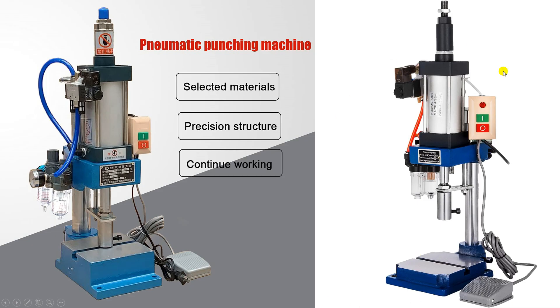As I told you, to start the circuit of this punching machine, we have to press the start push button. By pressing the start push button, the punching machine will not work — only the circuit will start. After the circuit starts, if we press the foot switch, it will start punching.